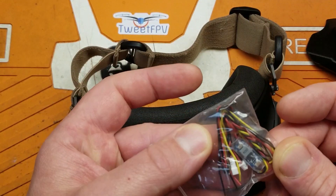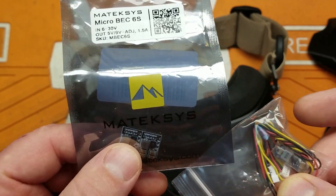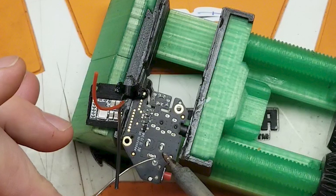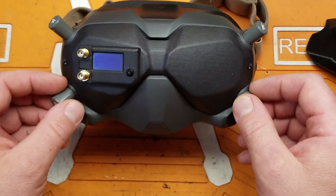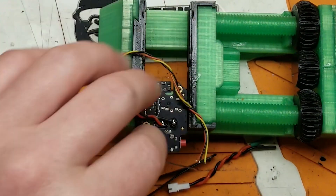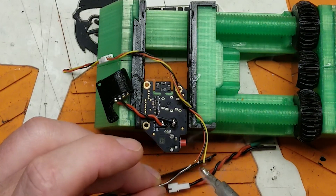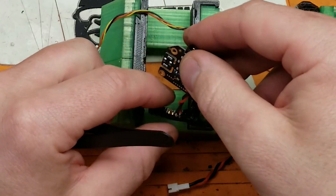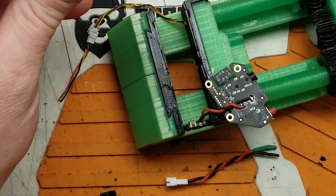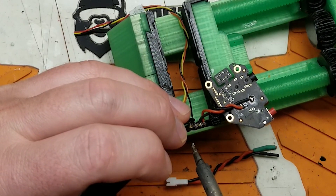I'll cover some highlights from when I was installing these. As far as the regulator goes, he used a Matek BEC — I'll put a link in the description. This is a much better BEC than the one IFlight includes: very low noise, very clean. He even has a little 3D-printed mount that he developed for screwing that BEC onto the power board inside. He also designed it to hold a capacitor, which is specific to whatever cap he used — I found it wasn't really necessary to run a cap, as there was no video noise in my setup at all when I was done.